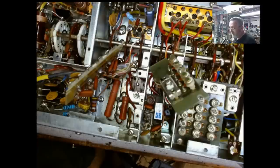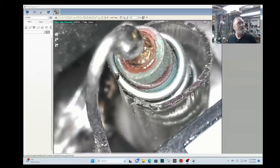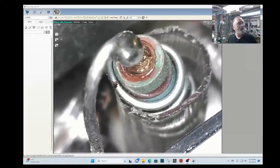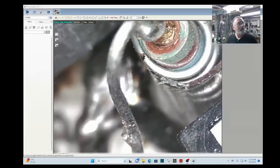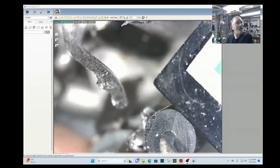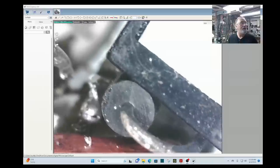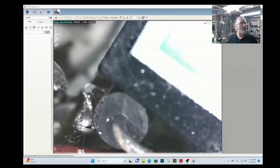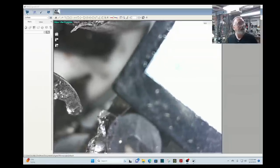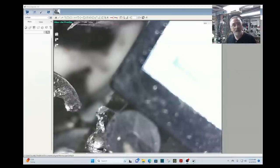So now I'm hoping I can fix that, put this back together. I'm going to have to check that 12BY7 to make sure it didn't burn up, and see if I can get this thing back tuned up. Here's the coil — I'm using the little Dino light to focus in on this. You can see L1 there and this top lead just hanging in space, flapping around, not connected to anything. It connects right where you see that blob of solder next to that other round body component, which I think is a resistor. That flying lead broke off, left-hand side, when I moved the radio after getting it working.